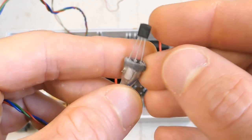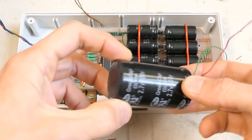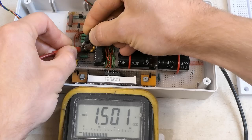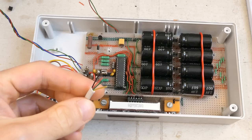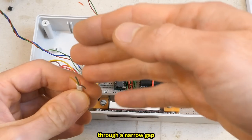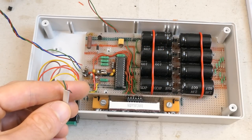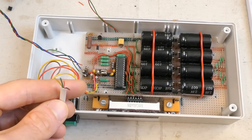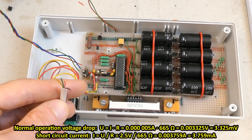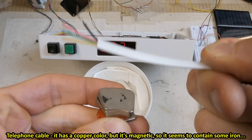I've made a sensor testing socket out of a fragment of a chip socket. The self-discharge of these capacitors improves very significantly after keeping them charged for a couple of weeks, whereas the self-discharge of a capacitor from eBay does not improve at all. Here is the 1.5-volt voltage reference. For the probe I'm using a flat cable which can go through a window. Even if the cable got crushed and shorted, it won't damage the device because the power to the sensor goes via a resistor. Since the sensor draws just about 5 microamps, the resistor drops almost nothing in normal operation — just several millivolts — but in case of a short it would limit the current.